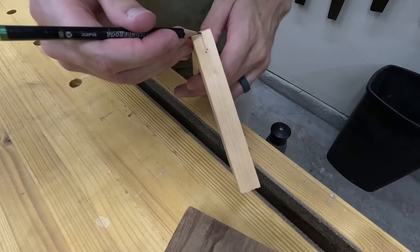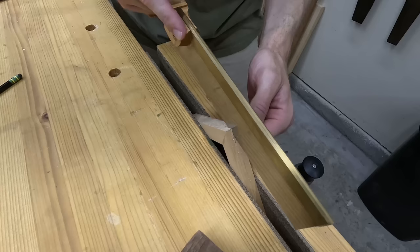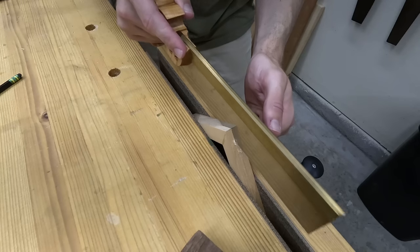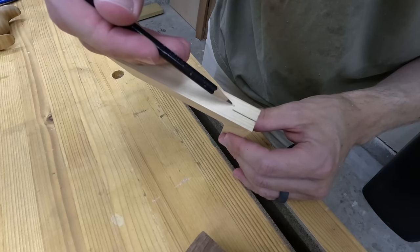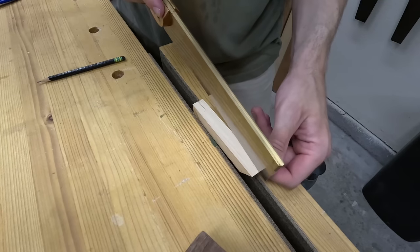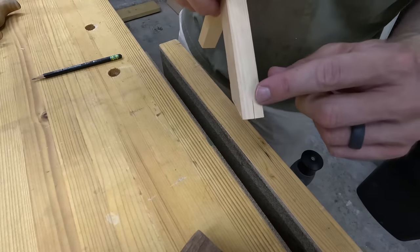So you can take a little sawdust glue putty kind of thing and fill it up with that. Or if you really want to get rid of those pinholes, you could get a little sawing practice in and saw down that miter connecting those two pinholes to totally eliminate it, then insert a spline. I'm using a regular dovetail saw — the kerf is just wide enough to perfectly knock out those little pinholes. Throughout filming this video I'd clamped up this corner twice, so there's two pinholes you can see. The kerf of a dovetail saw totally knocks that out. But obviously you would only saw this after the corner is actually glued up.